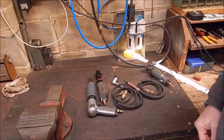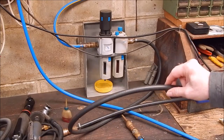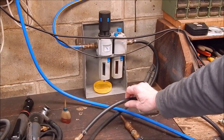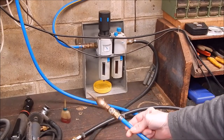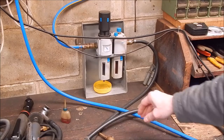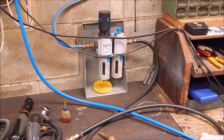If you're going to have in-line oiling, get a proper one. I've got a Festo here which is a proper industrial unit. It's a dedicated airline and it's a good unit. The downside is you have to use a dedicated airline for the air tool because the airline will be contaminated with oil over time, and you would never want to use it for air dusting. I've got two separate lines here — one's blue, one's black. Blue is clean dry air; black is air that's gone through the automatic oiler.